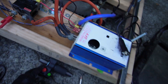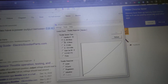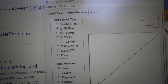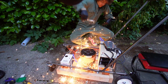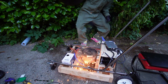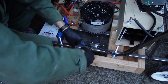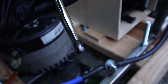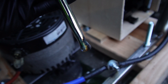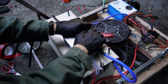I'm explaining that this controller does not work with a hall-effect type sensor like you'd find on an e-bike or scooter, so I had to go with the resistive type. That bottom cable was accidentally resting on the frame and that ratchet was not insulated — that's what happens when you're just not paying attention and you've got some amps to work with. The electricity took a chunk out of the metal pretty quick — good little stress test for the batteries. Just keeping it simple with the BMS mounting — just some double-sided tape, does the trick.